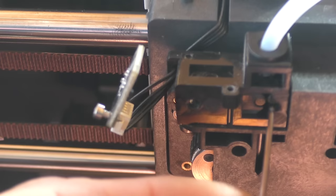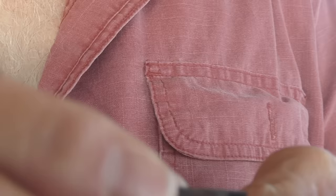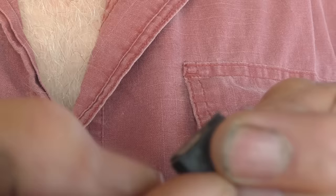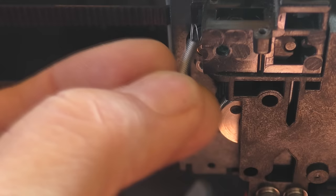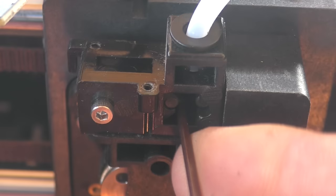I tried a pair of pliers on the stripped screw - the pliers worked. Took that screw all the way out, and there's another one below that I backed off. Now we can slide the sensor back. There's the spring. I got the wires clipped back in - it should be free now. There's a little grit in there that's probably not helping. We can also take the spring out and stretch it ever so slightly. There didn't seem to be any lubricant in there, but the little piece of grit may have been the whole problem. Same orientation, slide it back in, and reassemble.